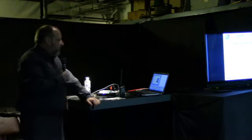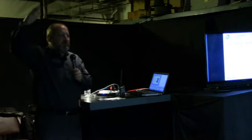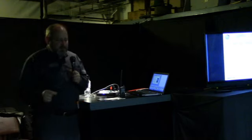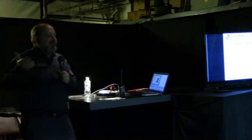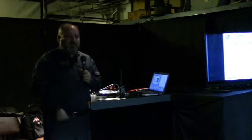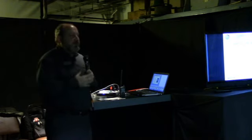One is you have this nice failure mode. People say, well, what if the internet's not available? Then DSTAR is useless without the internet. Well, certainly some of the functionality is not available if that's the case. But worst case, it's the same thing if you have an FM repeater with EchoLink, right? The internet goes away, you don't have EchoLink. You just have an FM repeater, right? I mean, everything else is still there. It's still a repeater on a mountaintop.